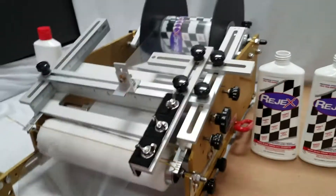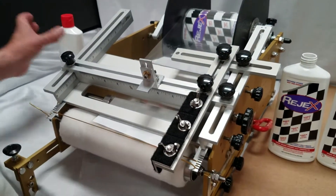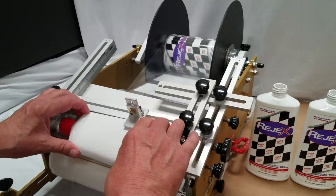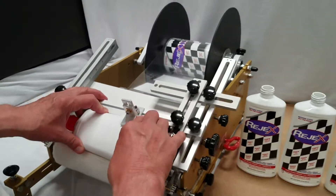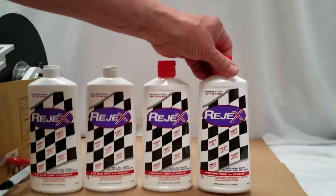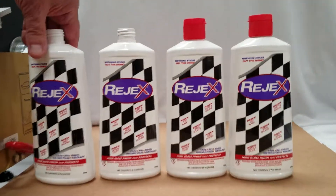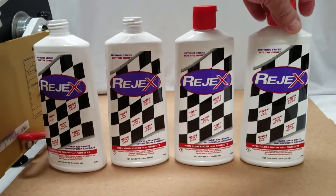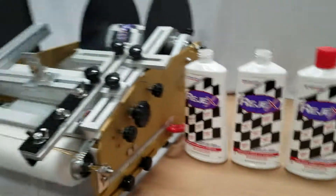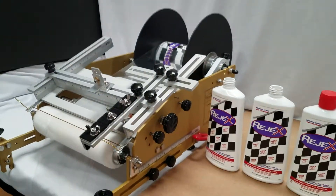Once again: out to the indicator cord, into the nesting area, teeter it up, push down with the spring plate, and swipe the label on. Each label will be in the exact same position — it's all straight across, applied perfectly, no bubbles whatsoever.